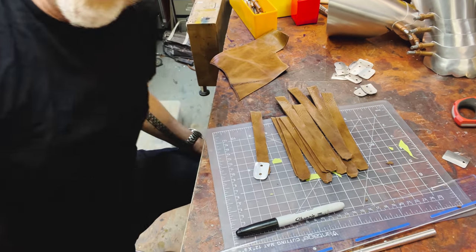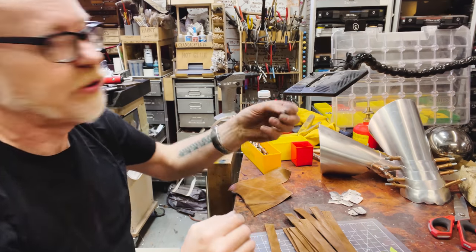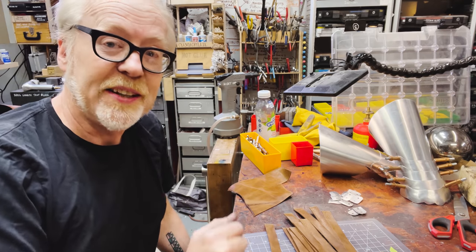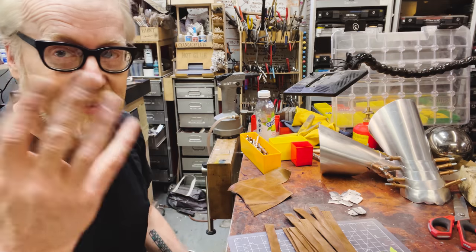And I'm going to make one modification here. I'm using these nice soft aluminum rivets for the very fingertip, tippy-tip rivet that you see. But all the rivets that you can't see, I'm just going to use blind rivets, normal pop rivets, because you won't see them.